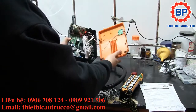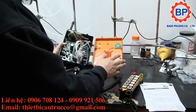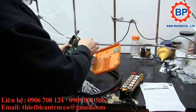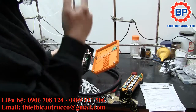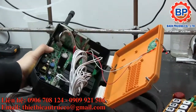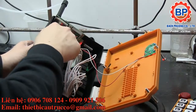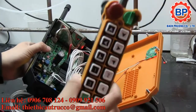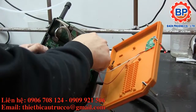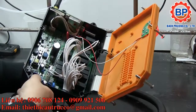Alright, so digging right back into this. Also, the hinge is just a piece of plastic, so that'll probably go after a few uses. You're not really supposed to go back in and out of this thing. The RF receiver is actually shielded, which in pictures of other ones online, they aren't. Let me zoom in a little more here so you guys can see. So it's actually shielded. They do have instructions as well to change the crystal, so you can use a different frequency control pendant. And they've got this other little antenna in here. I'm not sure if this is supposed to be the counterpoise for the RF. There's a little spring antenna on the side. Not quite sure what's going on there.